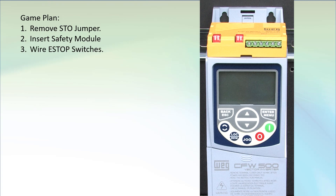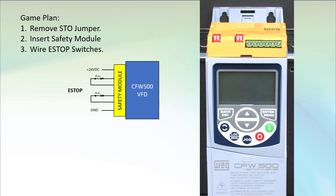There are two ways you can wire this up. You could simply take an e-stop switch with two normally closed contacts and wire it directly like this. The problem is you have no way of knowing if these normally closed contacts are going to work when you need them. If they get stuck closed, then when you hit the switch, your system won't shut down and bad things happen.